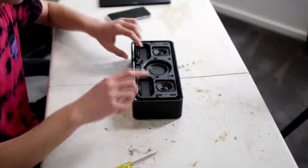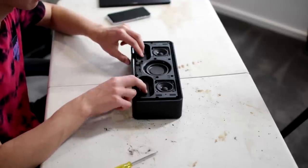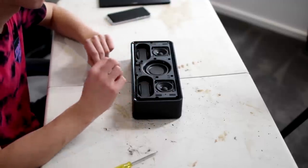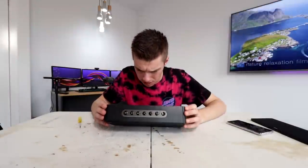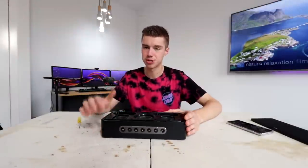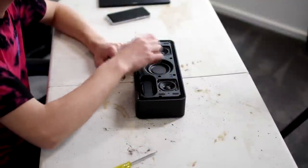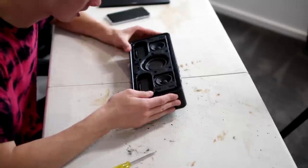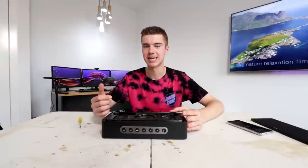If we look over here on the second camera, if I press both these passive radiators in, the subwoofer driver rises up very quick and drops straight back down. That means that this box is in no way airtight anymore. So all the screws are done up so tightly around the perimeter. You can see there's 1, 2, 3, 4, 5, 6, 7, 8, 9, 10, 11, 12. They are done up that tightly that I was worried I was going to strip the plastic.